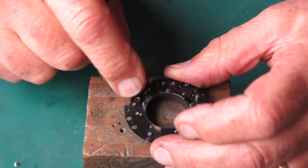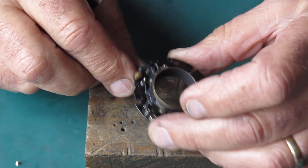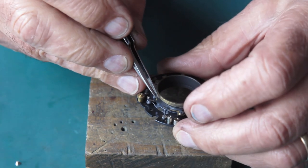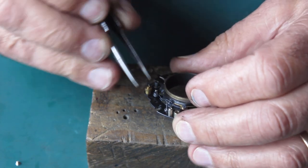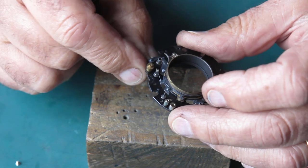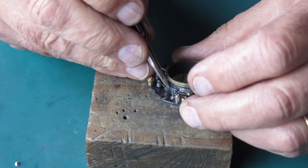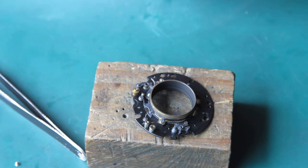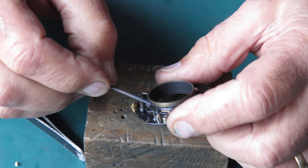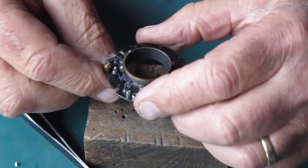The mechanism plate is a bit stiff. It may be that there's not enough lubricant where that detent runs over that pin. If I unhook it and poke it to one side I'll get a better idea — yes, I think that's the case, because when I unhook that there's now no friction at all. So basically that needed a touch of lubricant. I'm just going to lubricate that with a bit of molybdenum paste and check the action — that's much smoother.